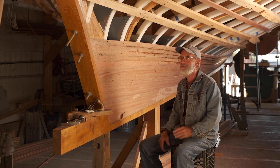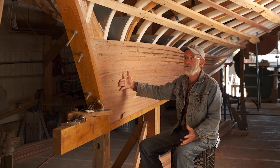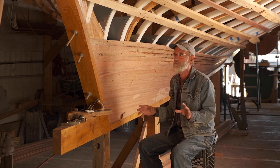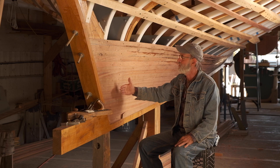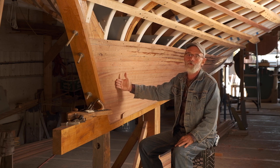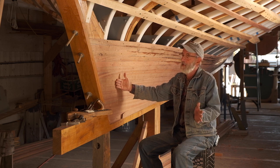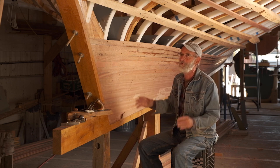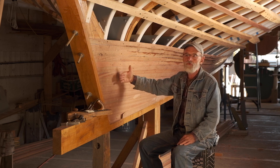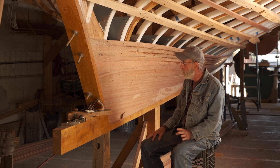It saves time and it's easy to do. I think it's a fantastic system for people building strip plank hulls — even single layer — for people that are unversed in carvel planking and some of the complexities of that type of construction. This was originally designed so that I could get a large crew to put planking onto a very large boat as fast as possible. I came up with this system and once I got working with the crew, I was able to teach them carvel planking, and that's exactly what we're going to do here.